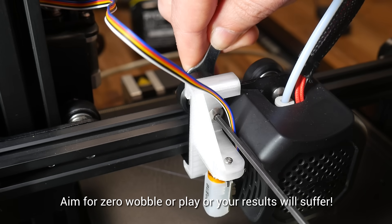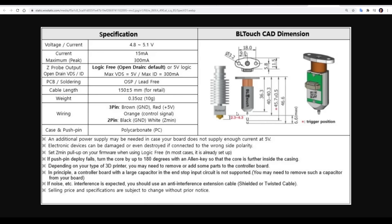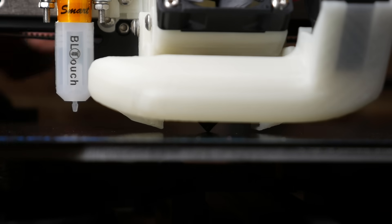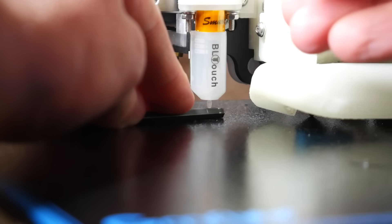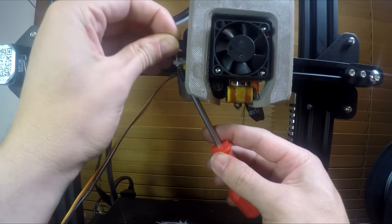For this accuracy we also need to pay attention to the height the BLtouch is mounted. There's a lot happening in this diagram but it tells you that from the tip of the hot end to the tip of the BLtouch you need a distance between 2.3 to 4.3 millimeters. With the printer off, manually lower the nozzle until it's just touching the bed. A 3 millimeter allen key is in the middle of this distance range and you can see if it fits underneath. If it doesn't, you can adjust your BLtouch up or down if the mount is an adjustable type. If you're using a fixed mount and the BLtouch is too high you can shim it downwards with washers, but if it's too low you're going to need to find and print a different mount.